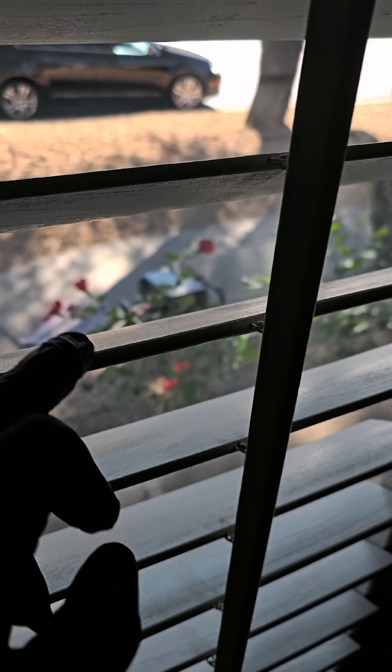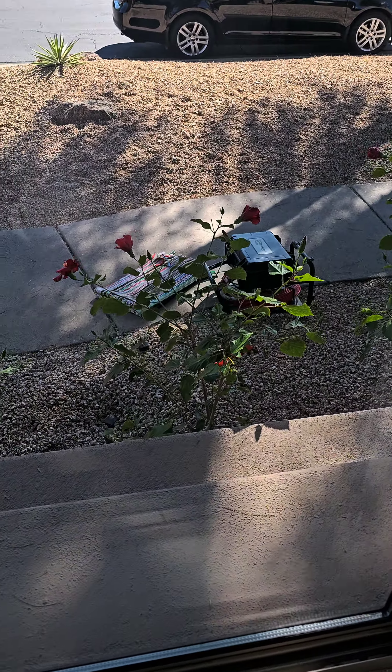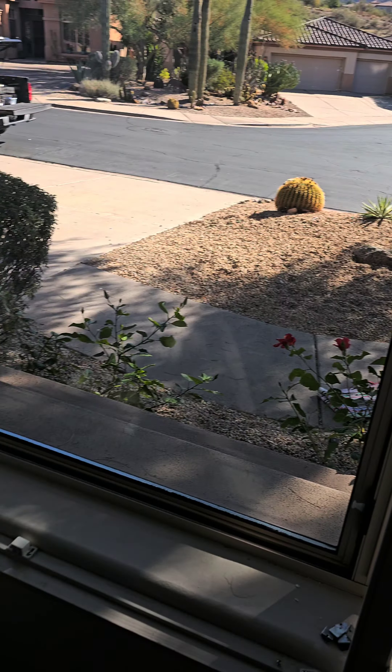In the front room, we're going to be doing the sewer camera inspection. Right there are our clean-outs, just on the other side of this window. We've got two of them — one is going to go under the house, the other one's going to go out. ABS pipes on a 25-year-old home; I'm not expecting much, though after a remodel they can drop paint, parts, and tools down there. The only way to know is to stick a camera down there.